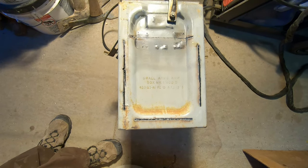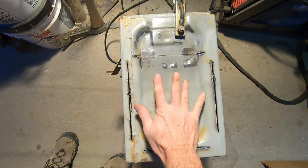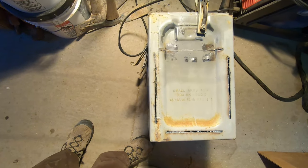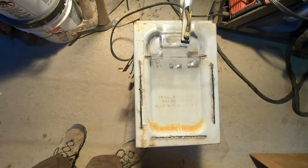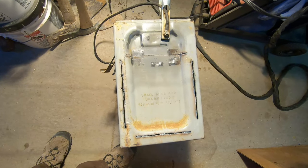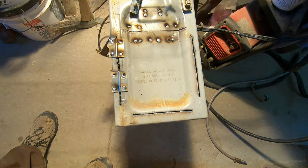So I started with a straight edge cutting the straight sides and the top and bottom of my door, which is going to be eight inches by nine inches. To give you guys an idea of how much bigger this stove is, I'm going to weld the hinges on this side before I cut the door. I like to do that — it's way easier to keep the door in tack, put your hinges on, and then finish cutting the door out so it's right where it needs to be. So let's put some hinges on it.